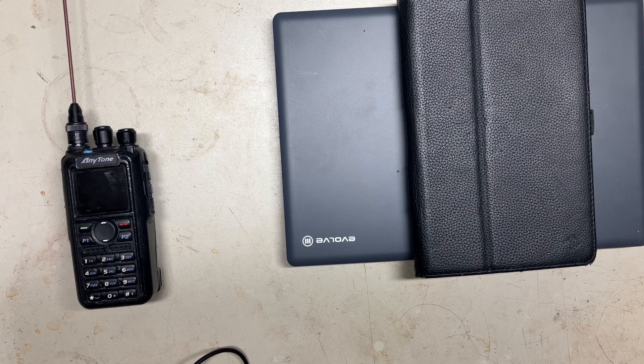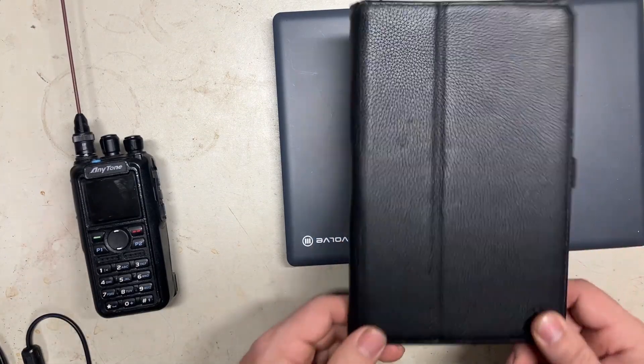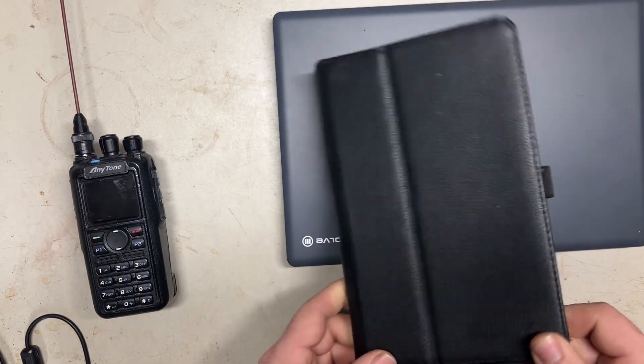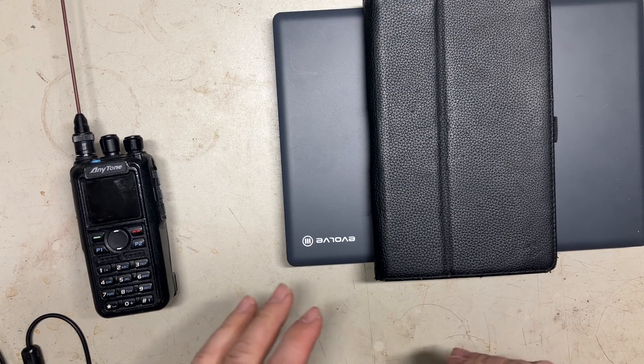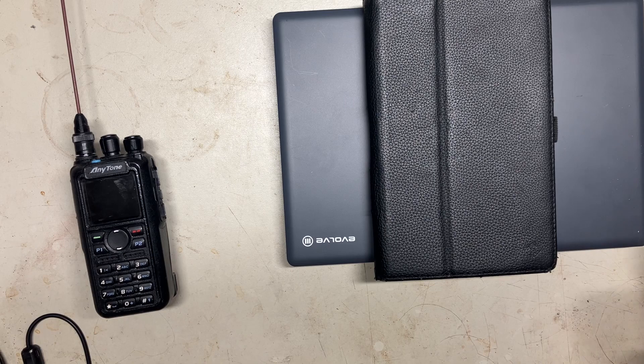However, if you're doing other things with VHF and UHF — your 2-meter, your 70-centimeter bands — there's not a lot of radios that have built-in options for that. So we're going to take a look at the simplest solution first. The simplest solution is a radio and your computer or tablet, and this only works if you're running FL Digi or another application that does not require a handshake between the radios — meaning it's a one-way transmission that requires no automatic acknowledgement back from the other radio.